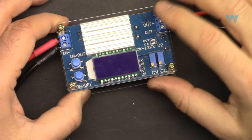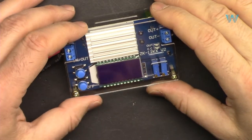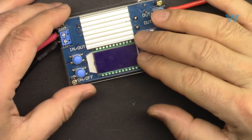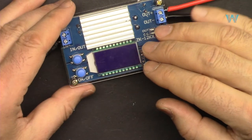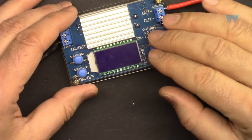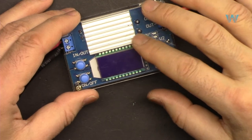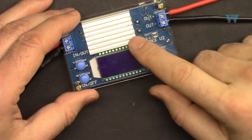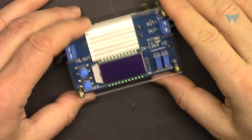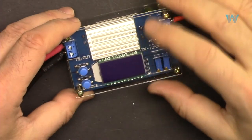For conclusion, I would say under no circumstance I was able to get 12 ampere, but 10 ampere and lower we were able to get. And depending on the power and voltage setting, you cannot get, for example, at 18 volts or 12 volts, 160 watt because the amount of power also depends on the current. So the current cannot be greater than 12 ampere at the output or 160 watts. But up to 10 ampere, it works very well in majority of the voltages.